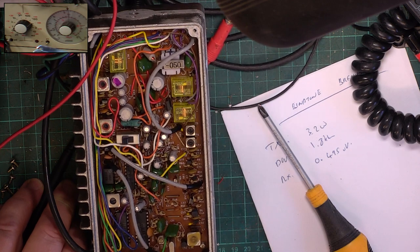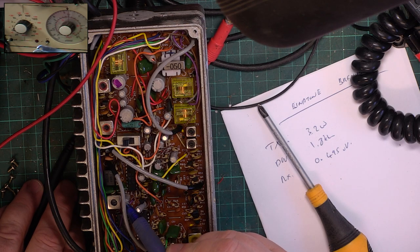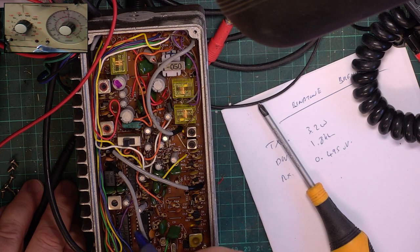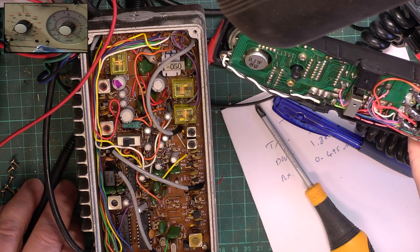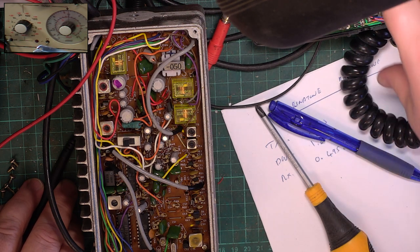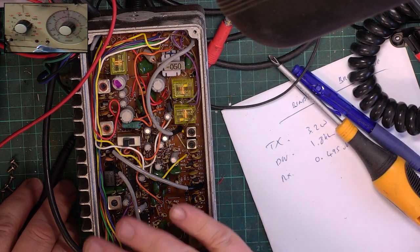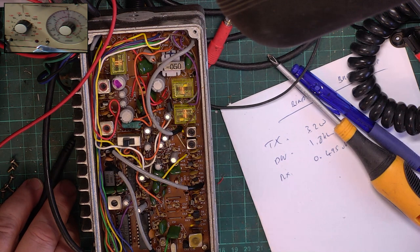So you have, if we can see this, your LC7136, the synthesizer, then you have an LC7181 scan generator, then in here you have the LC7191, is it, which is a data receiver. So what happens is you have, if I remember rightly, serial data going up and down the cable, whereas on the Realistic you've actually got all the individual channel selector wires. So this is technologically, it's got scan inside, although it's not used. Technologically it's one of the best.